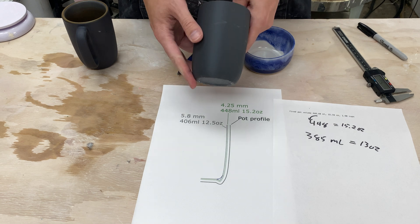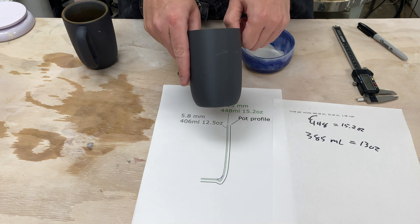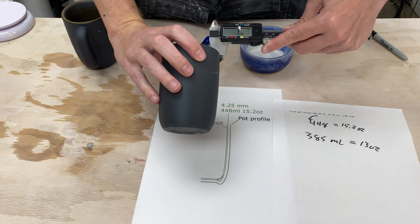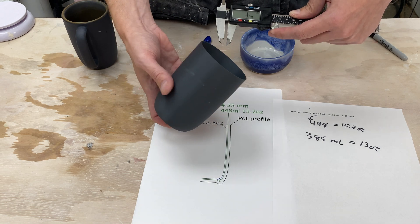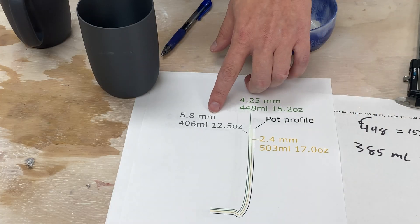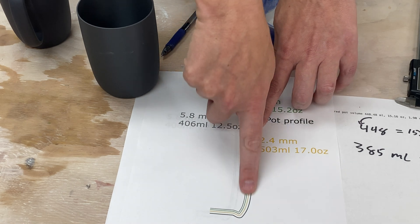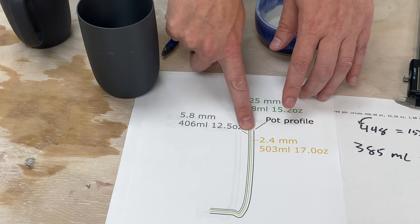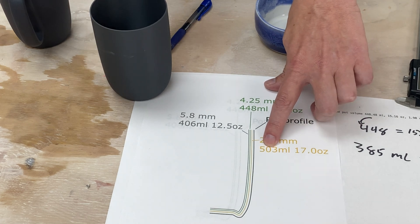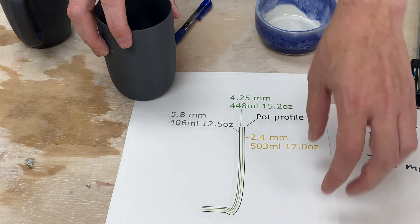But can we test this even more? I can put water in this 3D print and see how much volume it takes. I know the thickness of this — it's specified in the software as 2.4 millimeters, and it's meant to be relatively thin so you can print it quickly. When I try to measure it, I'm actually only getting 1.24mm, which is interesting — there may be something else going on. Anyway, using the theoretical number of 2.4mm gives us 503 milliliters, or 17 ounces. So let's go ahead and try that out and see if we get close to 500 milliliters.